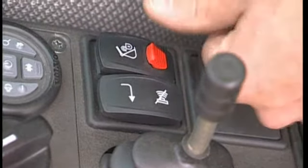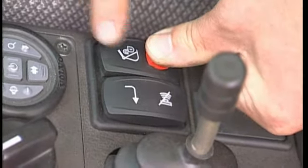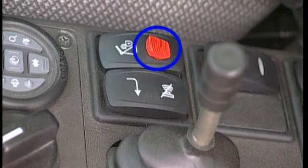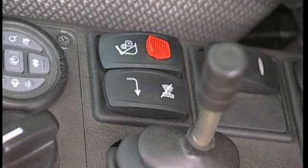Press the safety switch in the cab to operate the hydraulic cylinder. This opens the wedge under the pin. As this is a safety switch, you must first press the red knob on top of the QuickFit switch to be able to press the main switch down. As the operator, make sure this switch is always intact and functional.